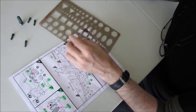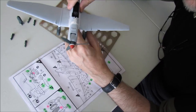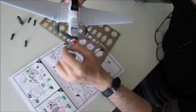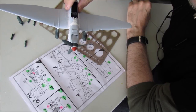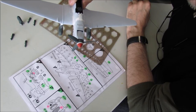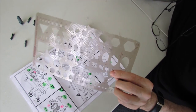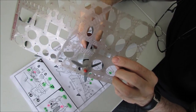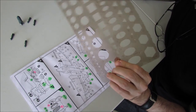So that's how I did that — just an idea I came up with. Because you know what it's like trying to mask around a formed, profiled surface — it's a nightmare. You get creases in your masking tape, you've got to put on multiple pieces, or you can try bending the masking tape as you go along putting folds in it, but then there's a risk of airbrushing bleed going between those folds. So I just used a simple circle template, chose diameters that created the spacing I needed, and sprayed the three different sections using the circle template. That's just a little tip if anyone wants to try it — or if anyone's already doing it, leave me a shout.